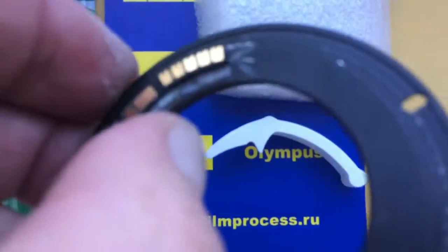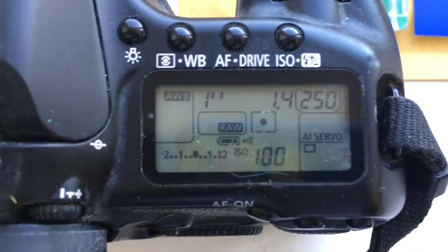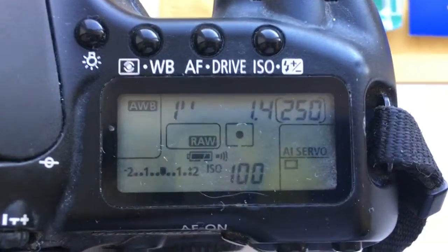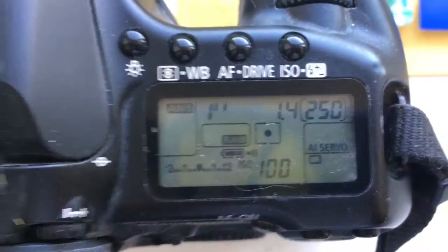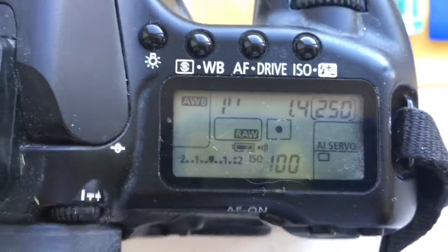Now I check it on my testing adapter in my camera. Look, I pre-programmed the chip as default. Focal length is 55mm and aperture 1.4. Delay time to enter in programmable mode is 1 second. You can always reprogram the chip per our programming instructions.